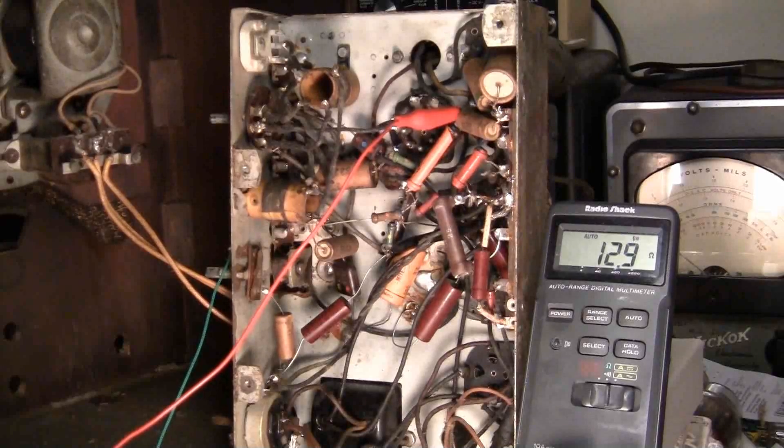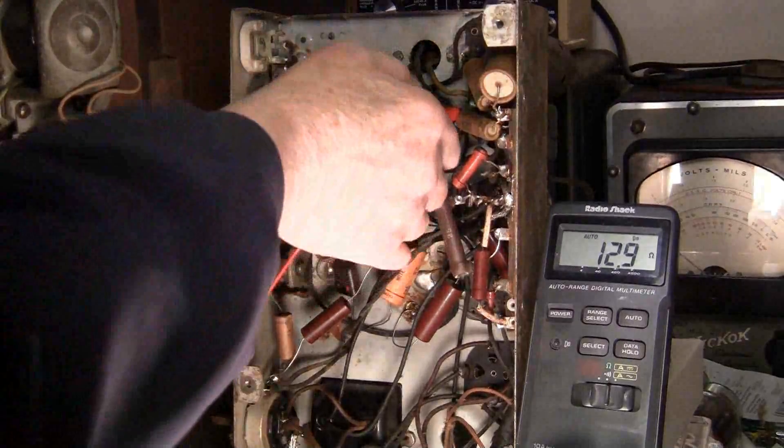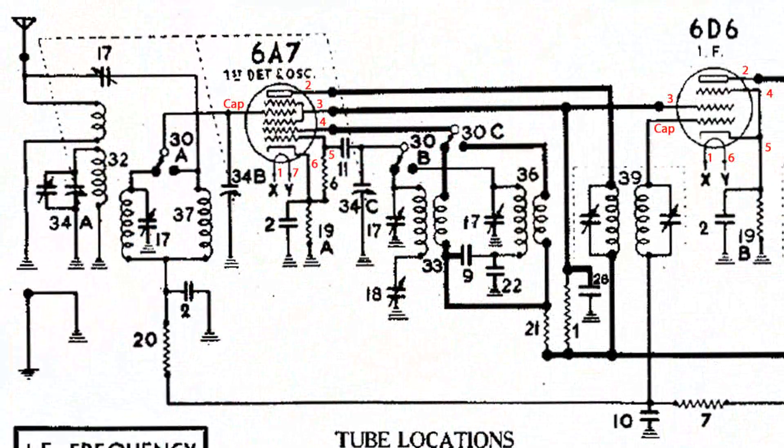The oscillator coil is very important, and I'm going to be testing these coils. Here are some suggested test points, but the way the coils are built it's actually easier than I thought, so this won't be too bad. Likewise, over here on the left, the antenna coils are not going to be too hard to test either, the way that they're constructed.